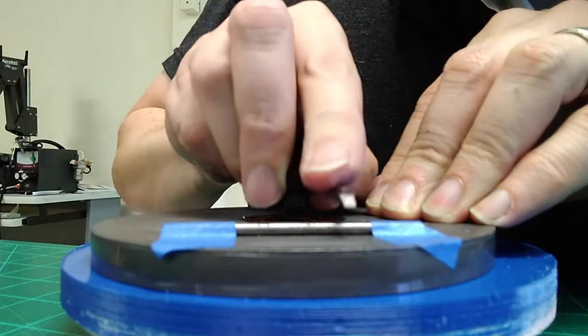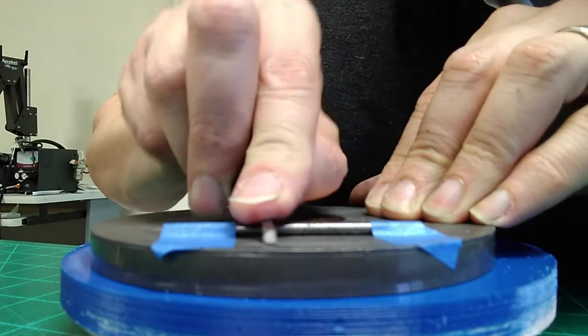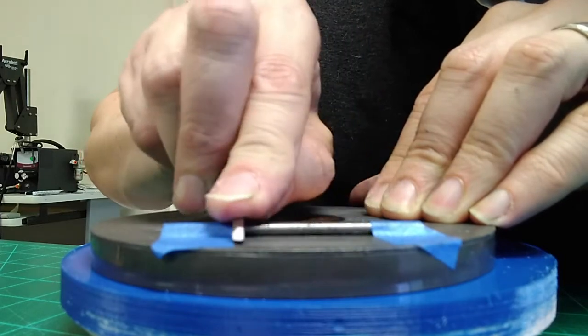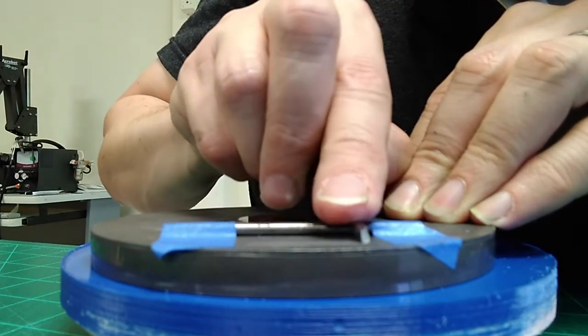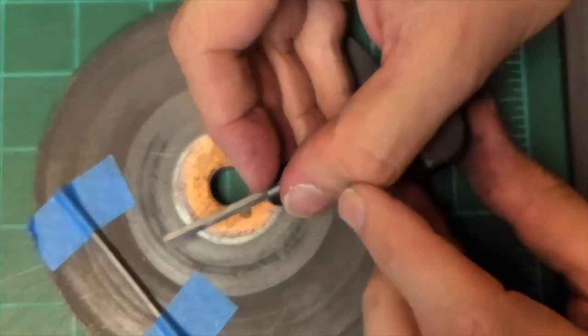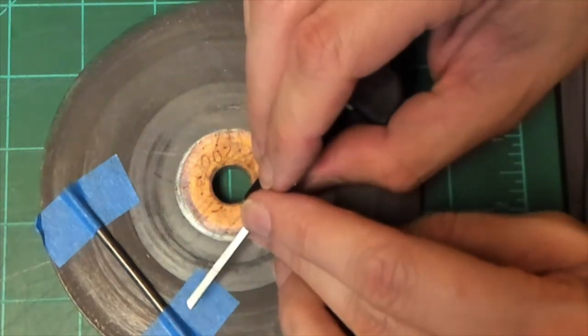Next, we will apply the heel to both sides of the point. Lay the graver flat on its side with the point touching the stone. Slide across. You will do this 4 times on each side. The heel will be the size of a ballpoint on a pen. You can see it reflected as you tilt it in the light. A better way would be to examine it with a jeweler's loupe in your kit. Try to make sure the heel on either side is the same size.